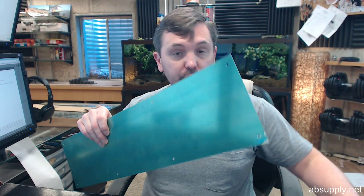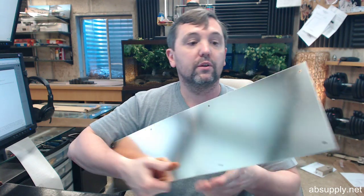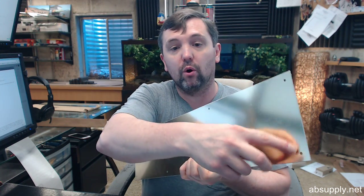You'll have a couple of options to select, and that's going to be either holes for the included screws, or you can have Hager manufacture it without holes, and then they will apply self-adhesive tape. Now, the self-adhesive tape is very appropriate for a residential application, or really any application, where you simply don't have the desire or the skill or the tools to drill and screw a kick plate onto a door.